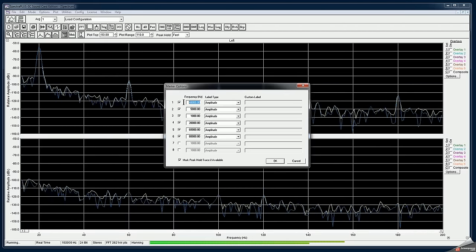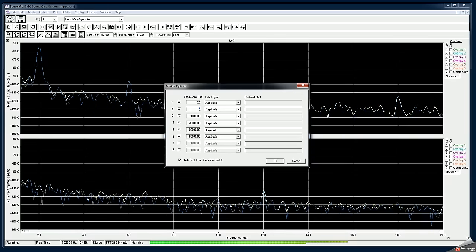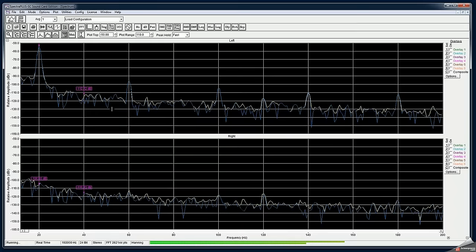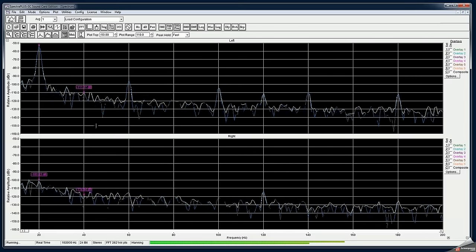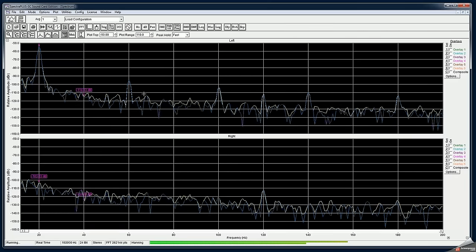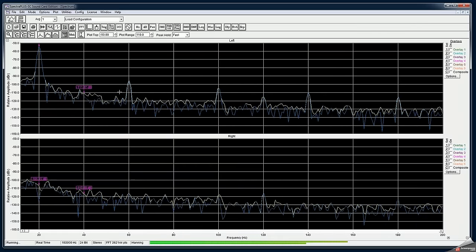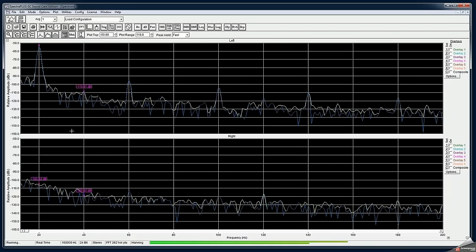Well, okay. Say 20, and then maybe we want to see the harmonics. Well, 40. Let's say we want to see 10 as well, but that's not. Okay. So this is 20, and 10 isn't showing up here. That's not a harmonic, this is 60. 60 hertz is showing through. Interesting. Yeah, I know it's supposed to be, but there's a notch filter installed somewhere that I've taken care of pretty well. At least I didn't see it before I tried this experiment.